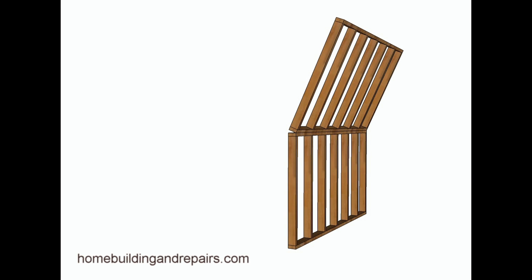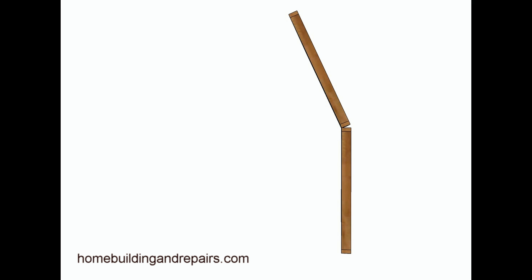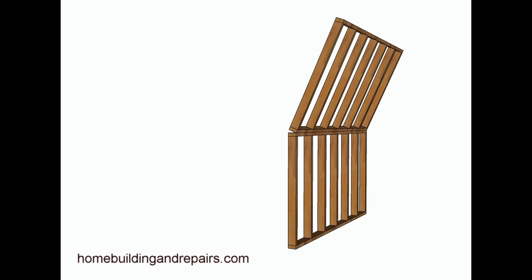What is a structural hinge point? Basically, you can see right here — if we had a hinge like a door hinge on the wall, we could actually move it back and forth. Any break that you would have in a wall, a continuous break, can create a weak spot in a wall that would allow it to move.